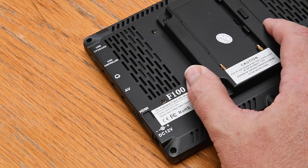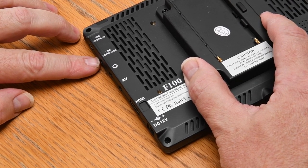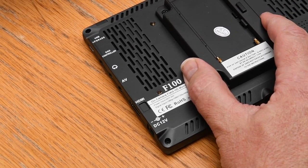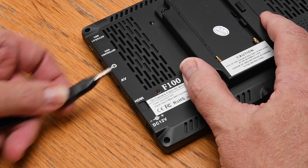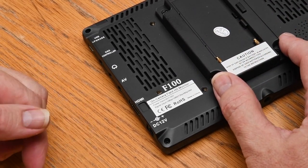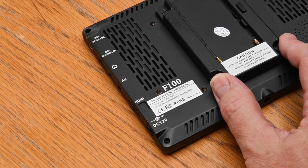Here's the connectivity for the screen. At the top is a USB upgrade socket to connect to a PC for firmware upgrades. The OSD controller socket is for a remote controller for the on-screen display. There's also a headphone socket — really useful. The AV socket is for red, yellow, and white AV plugs. Then there's the HDMI socket; it comes with two HDMI adapter cords — one for mini HDMI and one for micro HDMI, so they'll cover pretty much any input you want. At the bottom there's a 12-volt DC input if you have a mains adapter.